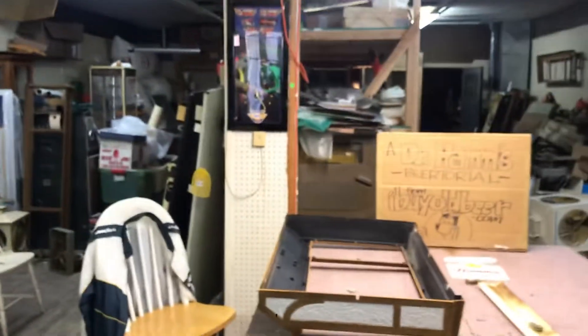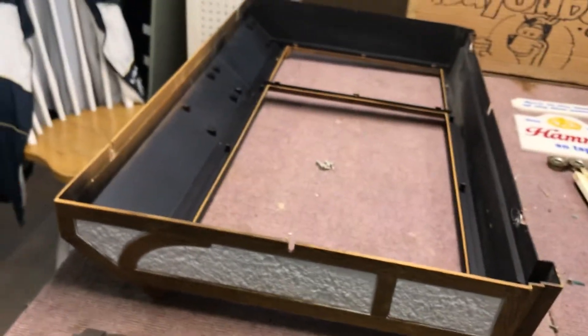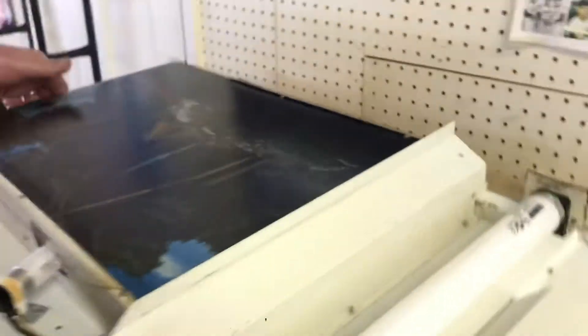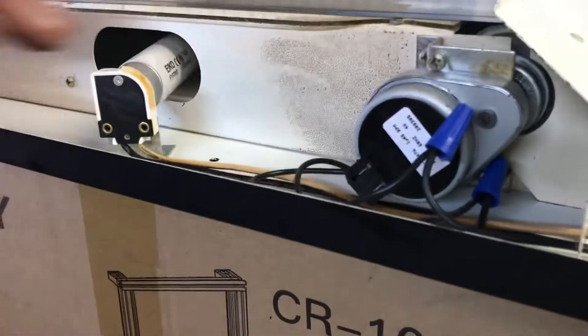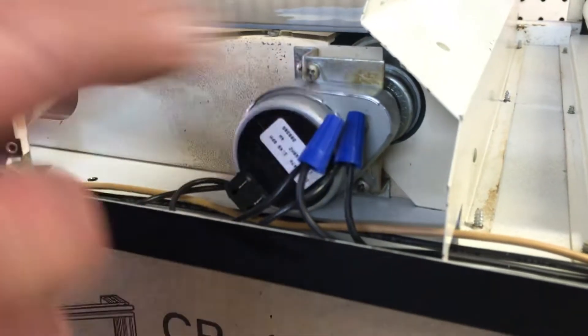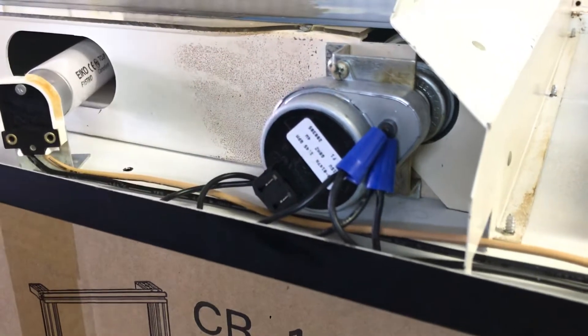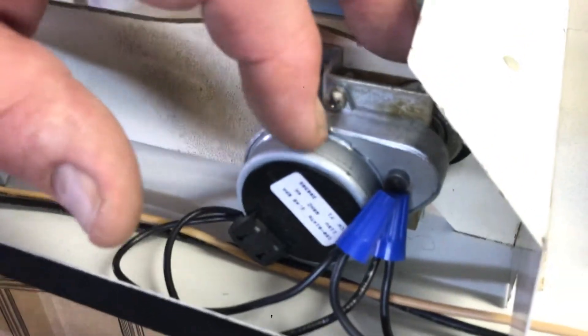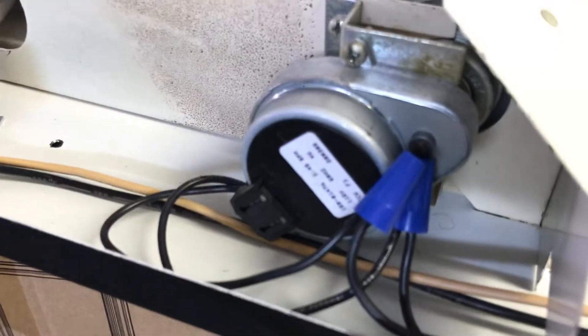My motors are made by the same company that originally made them back in the day — Auto Troll out of Illinois. Replacing motors on different signs — the Scenerama is fairly easy, a guy can do that at home. Here's a small Scenerama, this is the inside I'm working on, and here's the motor. Very simple — there are just two screws and two wires. It doesn't matter which way the wires go, the motor will still work. It's 1.45 RPM counterclockwise, and there's a small pin on the end that engages in the slot in the end of that roller.